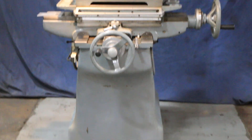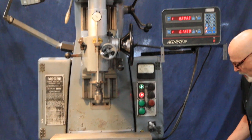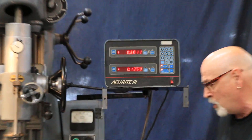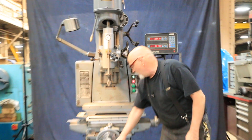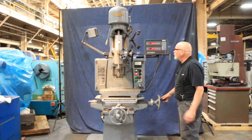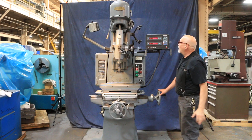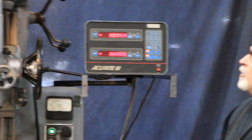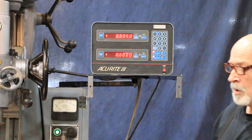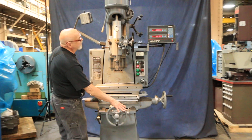You've got your two axes that you can move by hand. There's a special dial here where you can set the dial ring as well as the front axis. This moves very easily. We have a DRO up here for these two axes. I'm barely moving my hand and we don't have any backlash — very slight. Same with this one, very little backlash.